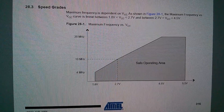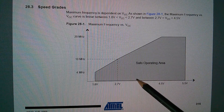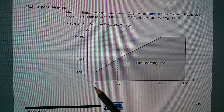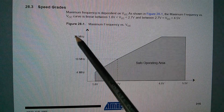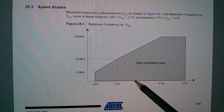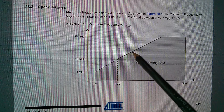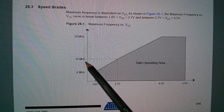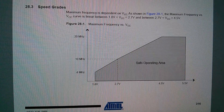Why the difference in clock speed? It's because of a graph on page 316 of the ATmega328P datasheet — the Atmel chip on the Arduino. You can see that if you're running the chip at 5V, you're safe to run it up to 20 MHz, and 16 MHz is of course still viable. If you're running it at 3.3V, you can't quite safely run it at 16 MHz.